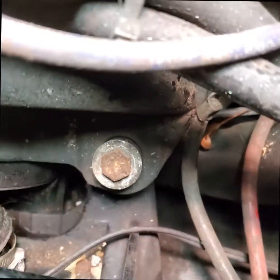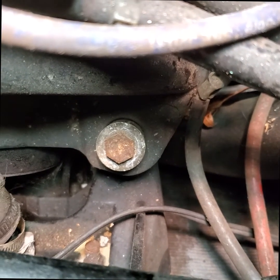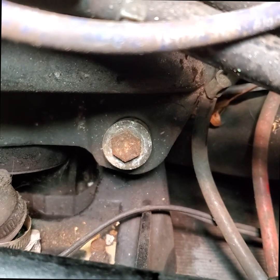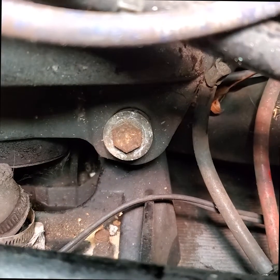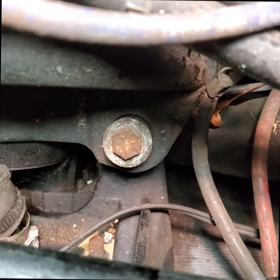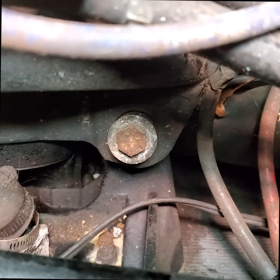So that's the head of the bolt right there. It takes a 3/4 inch socket and it goes through the backside of the aluminum bell housing. It goes through a double washer, and then through the transom assembly here, and on the bottom of it there's an aluminum nut, and that aluminum nut sometimes freezes to that bolt. So if you ever do take them out and you're going to put them back on, make sure that you grease them up really, really well.